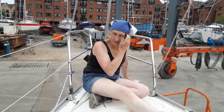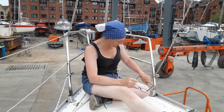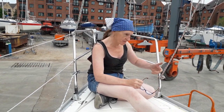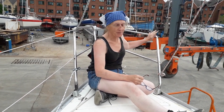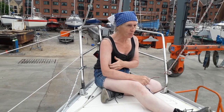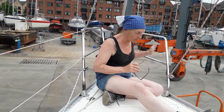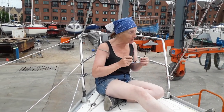So how are we doing Bev? I have no idea. This alloy unit is stuck - it's insulated so there shouldn't be corrosion, but I think it's just an extremely tight fit. We can't get the toerail off until we get this to bend and twist a bit, and we can't get it to bend because it's attached to the pulpit, and the pulpit is attached to the forestay - it's just a domino effect. We think if we can get this side sitting up and take the thing out the front, it might twist enough to allow us to remove the toerail.